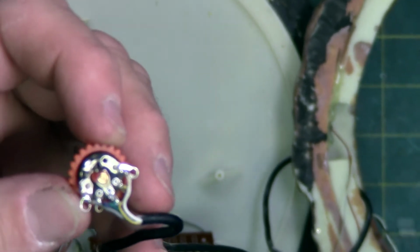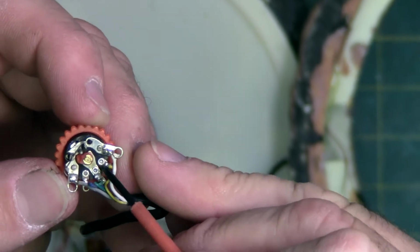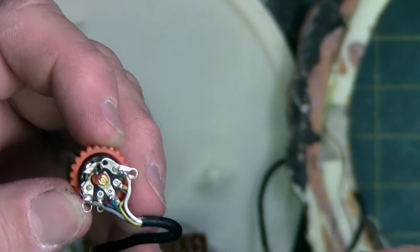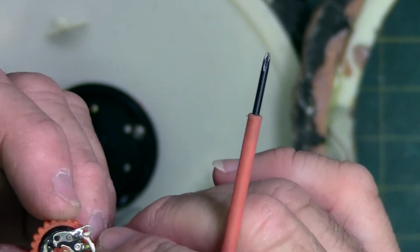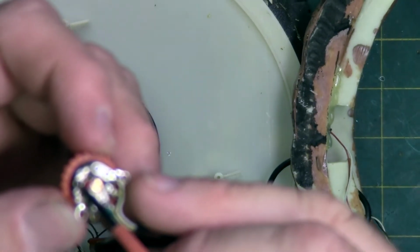If you have one of those units that when you turn it off it continues the cycle, it's breaking the connection here, but it's still allowing the connection in one of these 3 pins, probably the center one. So it can do its power down cycle to its reset point. So if you never paid attention on how these work, that's how it works. If this spring breaks, usually the switch is garbage.